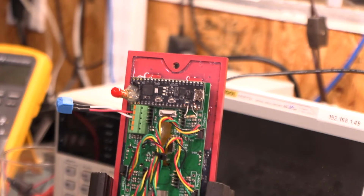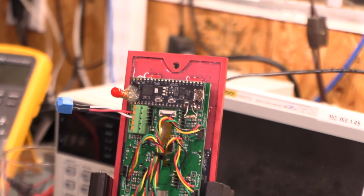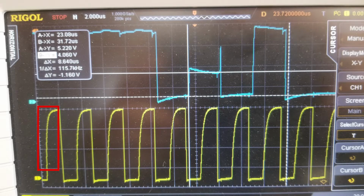Now that 5K resistor should have been at least twice as strong, strong being providing more current, than even a 10K. Even if the internal pull-up was 10K, the 5K would still allow twice as much current, right? And of course, if it was 100K, it'd be even more than that. So I was really surprised. I was like, wow, I would have thought... you remember how the SCL line was curved. I expected the SDA line to look pretty curved like that too.